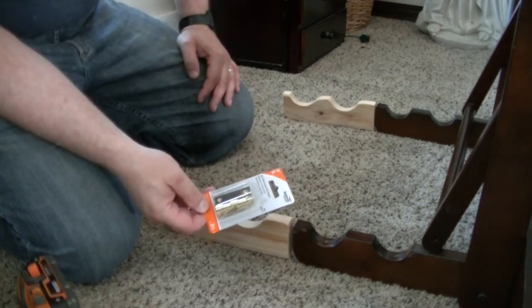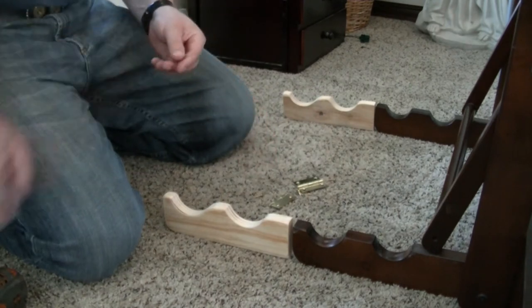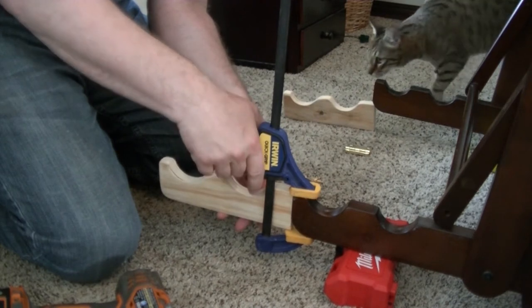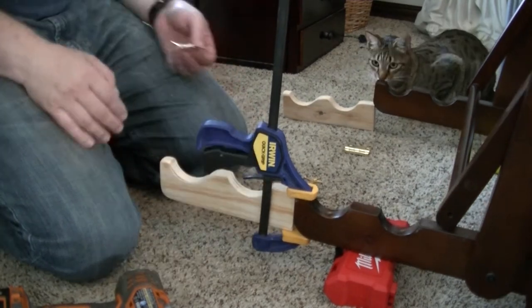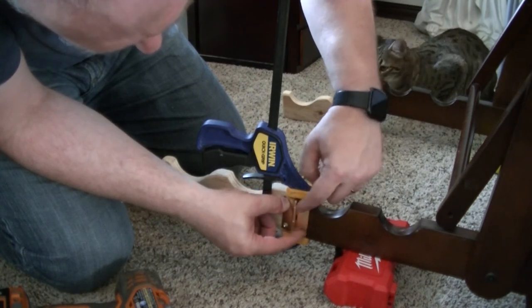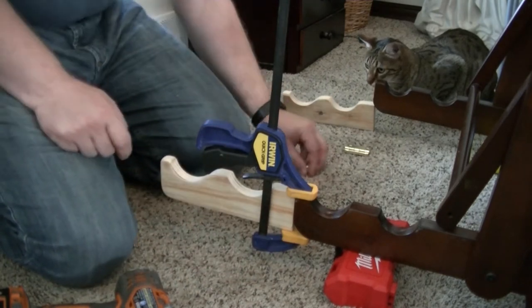I have these hinges, they're 2-inch hinges. Small. This is 1/16. That's what I'm gonna use. Darn small. That don't work for squat. I can get that. I gotta go past this curve. So if I show you what it is from the other side, I gotta go far enough in to catch wood there, which almost comes too far in. So it's a little bit of a balancing act to get it just in the right spot. I'm just going to barely catch the bottom. I'm a little concerned with that, but hopefully it works.